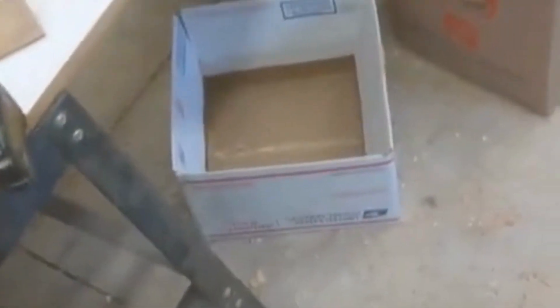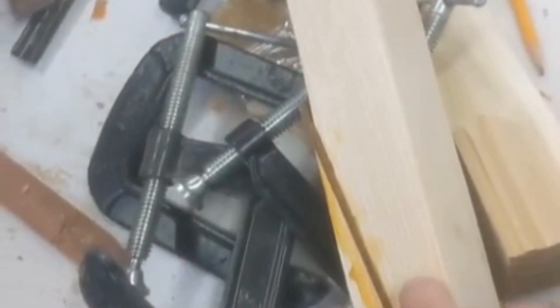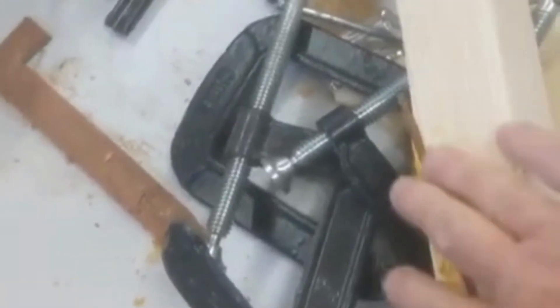I got it set up again, just like yesterday, only I got the two pieces in it crossed ways now and they're glued up there to keep it. You can see the smear that ran along the bottom — that's why I lift it up like that, to keep this from being glued down to my jig. Speaking of jigs, you can buy all these jigs, but I just make them out of stuff I've got around the shop. We got the two pieces put back together with this brown piece in between. The bottom needs to be cleaned off — I got a little out of whack, there's a little notch there. I'm going to run it through the joiner planer to get this bottom back to level.